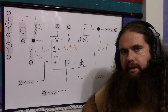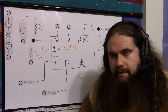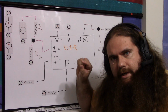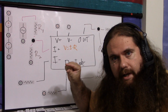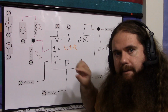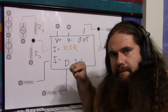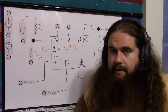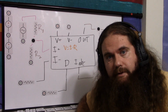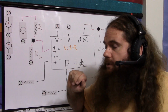Now, my chip, the LM13700, includes a Darlington emitter follower buffer on it. I tried to use it, and it's goofy and doesn't work, and I don't know why. But I put it into an op-amp in unity gain amplifier mode, and it works fine. So this part's working. If I put it into an op-amp and buffer the voltage that way, everything works fine. But my chip's onboard buffer, the Darlington emitter follower, is not working the way I expected it to. And it's not working the way the datasheet says it should. And I even confirmed the datasheet's circuit diagram with other diagrams on the internet, and they're the same, so it should work, but it doesn't.